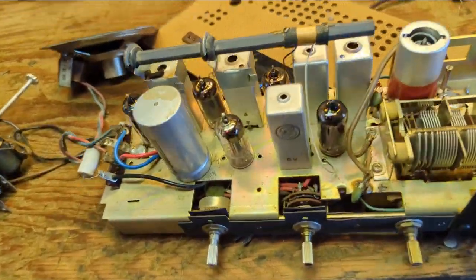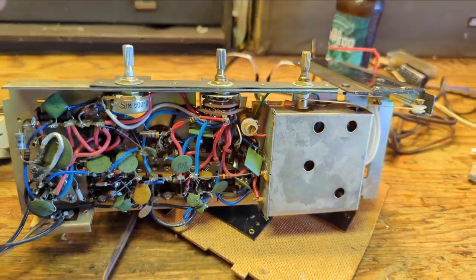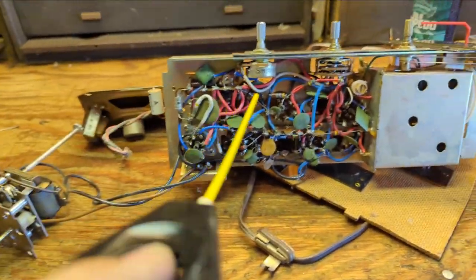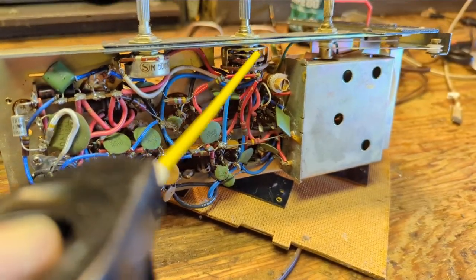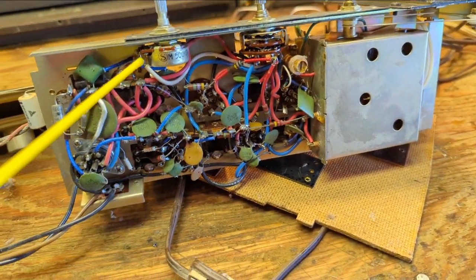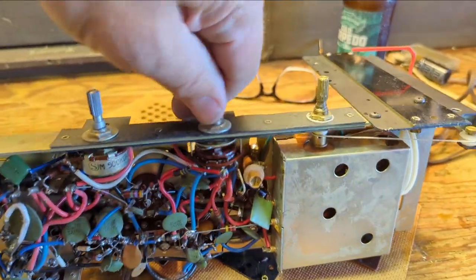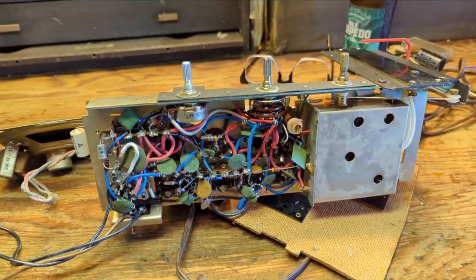This has cleaned up pretty well. Now it's time to clean up the pots. I'm going to use the right stuff this time — I actually bought a can of Deoxit. That one's not a pot, that's just the tuning condenser, so I don't need to worry about that. Let's work that back and forth. This guy's coming loose a little bit — I'll tighten up this nut, and then we'll give it a test fire.